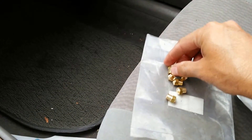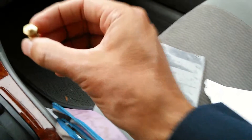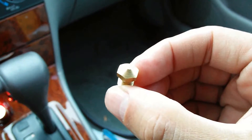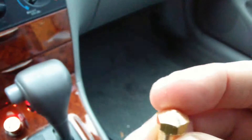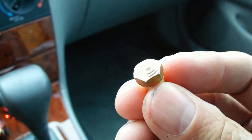This is one of the pieces I do - it's threaded, already cut, a finished piece. The top of it is smooth, and that's the way it should be. The cut should be nice and clean. When the tool starts to get dull, you see stripes along the finished piece, and that really shouldn't be the case - it should be as smooth as possible.